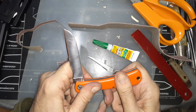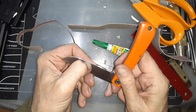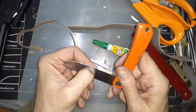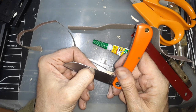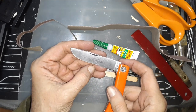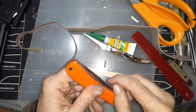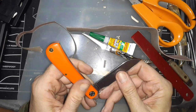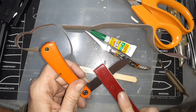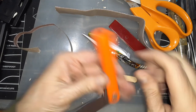The more raised up it is, the longer you'll have to do that. The less raised up it was — on this one, the indentation didn't go all the way back to the edge of the grind; the deepest part was just on the very edge of the knife itself. It's really hard to see what's left of it, but I would just sit there and file on it, let it drop, look at it closely, and then try to bring a little bit of an edge back — just go back and forth and file out that little cut on either side.